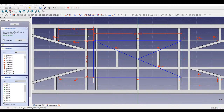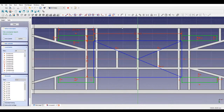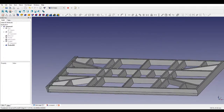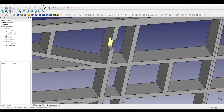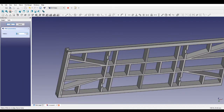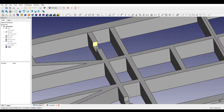Which now is more obvious that it sticks into these four members there. So if I make this 4 millimeters thick, that should be more than enough. And go 2 millimeters. You've got plenty of space, and it's not too obvious, as there'll be other stuff covering over the top. Just going to radius these as well, as they don't need to be so harsh. Only 1mm, as they still need to be functional.